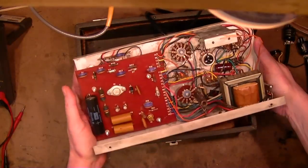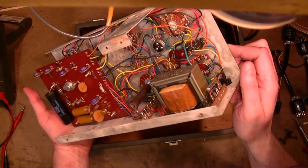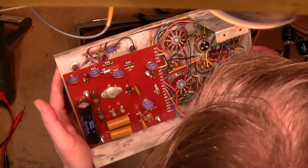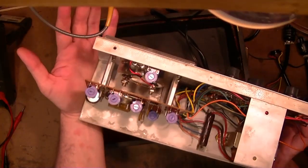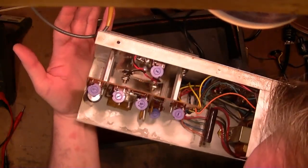There she is — looks to be in pretty good shape. It's fused and the fuse looks to be intact. All original, with two protection diodes across the meter leads. Hopefully those are good. Looks like we've got a number of calibration controls, a few diodes, a couple of transistors — well, a TRIAC, and a transistor.